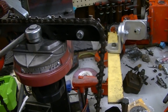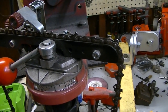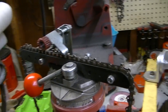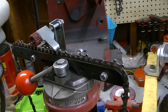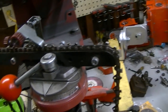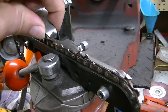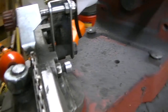To adjust the angle, you just loosen that knob back and forth. This direction is for cutting the right-hand cutters, this one for the left — very simple. When you get it set up right with the centering screw, you don't have to adjust the depth as you go from side to side. I usually have to back this off or spin it in about half a turn when I go side to side, but I've gotten used to it. This is your depth gauge — that controls how much of a bite you take as you come down. You can see there's a giant gap there for a different chain, so that'll have to be adjusted. This just adjusts your keying in and out as you go, and you want to get that right.